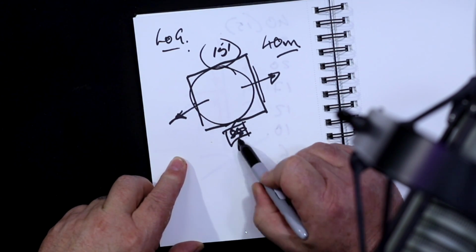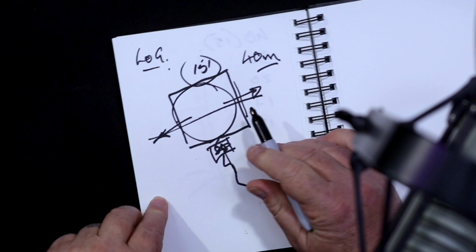You're getting gain roughly perpendicular to the feed point, though. Although I don't find that. I think at very, very low angles, you get slightly more gain. I haven't been using it at night, though, on 40 metres. I'm thinking of making one twice the size, because that 15 feet for 40 metres is just perfect. I'm thinking of making one twice the size for 80 metres. There we are.